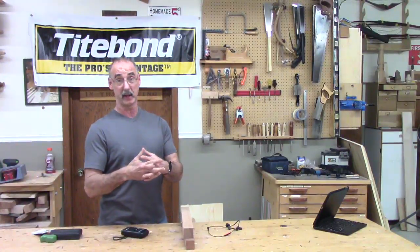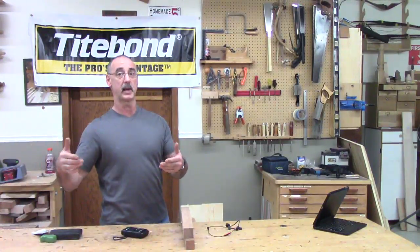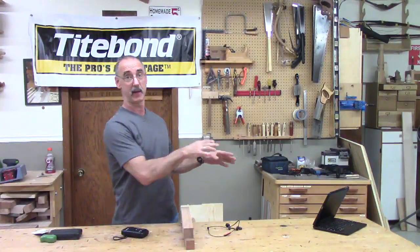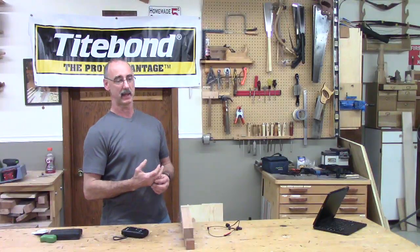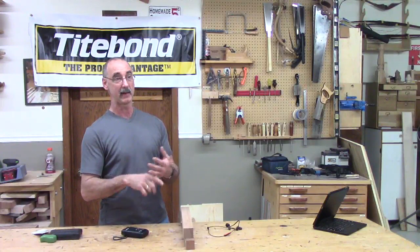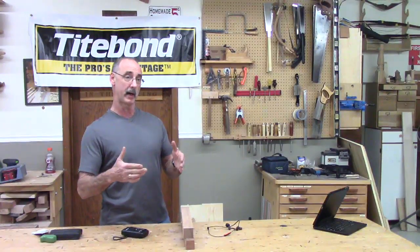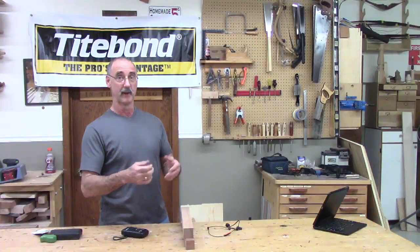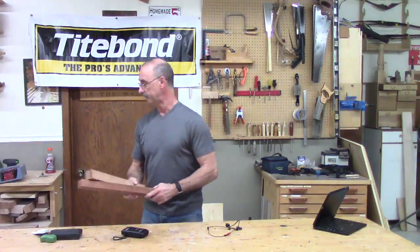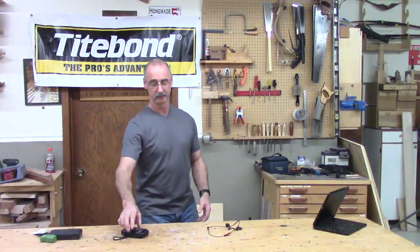Maybe if you metered the Sapele, you would find, oh my gosh, it's not 8 or 10%, it's 20%. Which is right away a warning sign: this is not ready for me to make into a project. I'm going to guess more likely this is another case where a chunk of wood wasn't dried correctly, and as a result, when you cut into it, it released a lot of internal pressure, and that's what made it go all kittywampus and kerflooey, or kerflooey and kittywampus, even, I don't know.